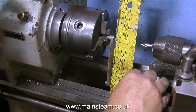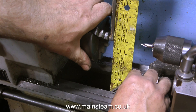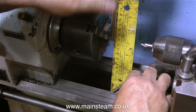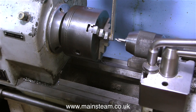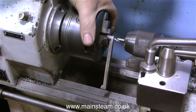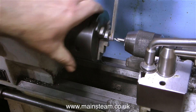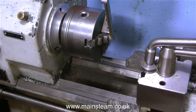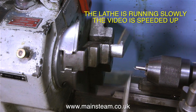How am I going to do that? Like this. I put the link arm in the chuck, rotate it and check that it's square at top and bottom. It did take considerably longer than this to get the link arm to be square in the chuck. I'm not in any big hurry to power up the lathe — first of all I'm turning the chuck by hand to rotate the part and make sure that the centre drill is exactly in the centre.